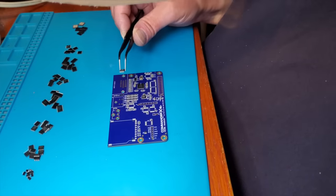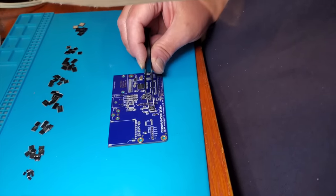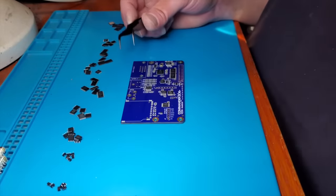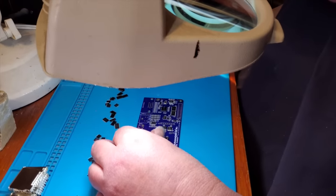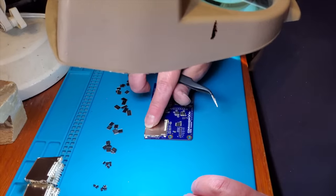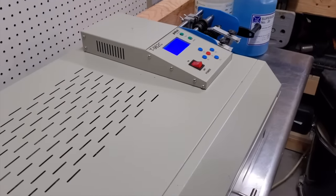So then came the process of building these. Now, first I'll show you the Vera boards, which contain actually more than just the Vera. They also have various video ports and the SD card slot on this daughter board. Now currently these are all assembled by hand, mostly surface mount parts. These take about 30 minutes to assemble, and then they go into an oven to melt the solder. And believe it or not, this is the easy part.